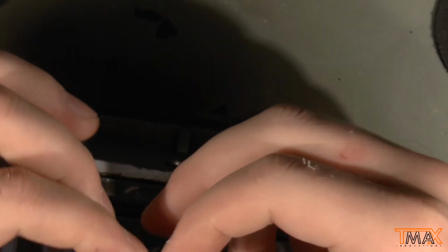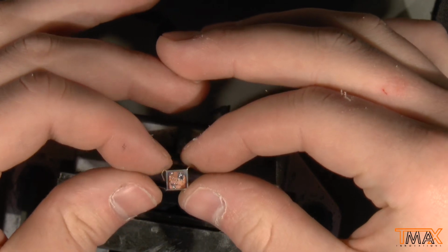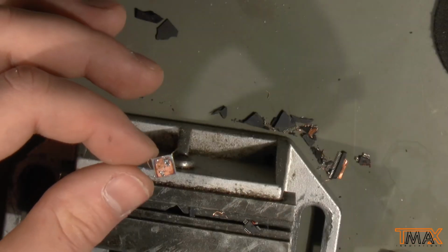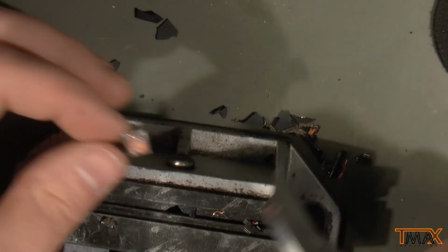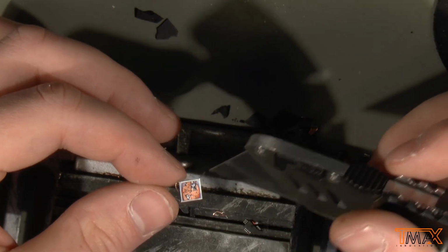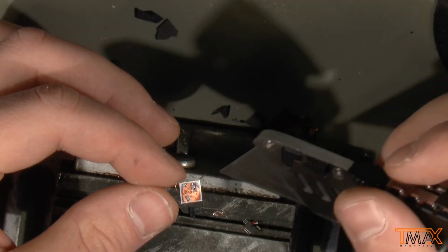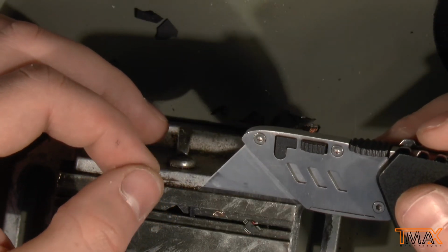You can see this is the lead frame. No, is it technically called the lead frame? It's sort of the carrier for the chip. And this is basically where the die sits on. It's been soldered down to this. You can see the remains of the solder. Why am I pointing with a screw? That's dumb. Let me just point with something much more safe, a knife. Ow, the pliers are hot. So this is where the die sat. Then you had a bit of a space here. And this is where the actual leads of the thing were attached to, which I think then get laser cut or cut somehow. And then the epoxy gets sort of squirted all around it.